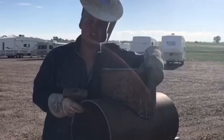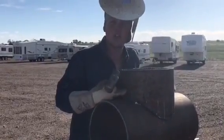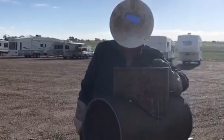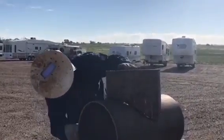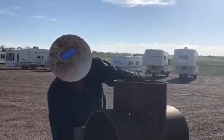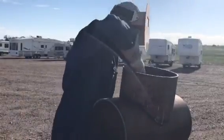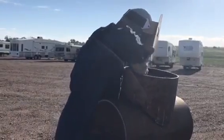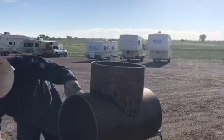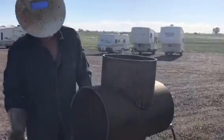Another thing is, if your ears are just a little bit big, once you get them tacked, make sure you run your throat, and it's going to kind of draw in a little bit and close that gap up a little. So anyways, get your wedge in there. That wedge is in there. So you're going to want to get your gap on both sides. You're going to run two more tacks in both sides, and then we'll go from there.